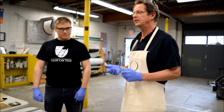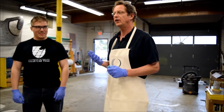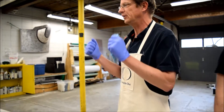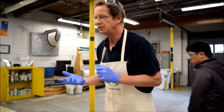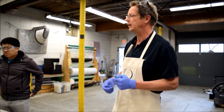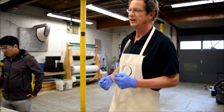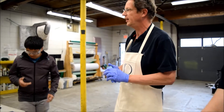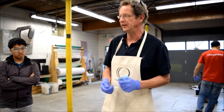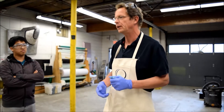Typically when you've got epoxies and they're talking about volumetric measurements, they're trying to sell you their metering pump system, which works great for doing small jobs. But when you're trying to mix 2 kilos at a time, a little squeeze pump is a little bit painful. So that's what I'm going to show you — mixing it, just measuring it properly.